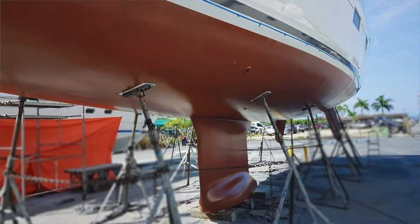You have option A: have the boat bare; B: have conventional anti-foul; C: have Coppercoat. And how much would it cost for roughly a 40-foot monohull? A 40-foot monohull will be in the region of £1,000 plus local VAT. When we were in the Caribbean, we paid something like $2,000 for anti-fouling for our boat, and that only lasted us 18 months. So the great saving comes from not having to have it lifted and reapplied.